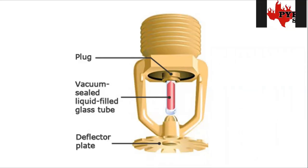This is why we talk about being really careful around sprinkler heads — not hanging things on them or using them to test for ground faults — because that glass tube is designed to break. That is the entire point: to break in case of a fire and dump water. Also, Hollywood gets this completely wrong. People pull a pull station in movies and get water dumped on them, which is obviously not the case. The pull station we install has nothing to do with the sprinkler head the sprinkler contractor installs.